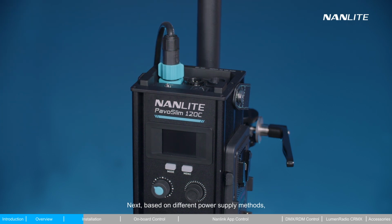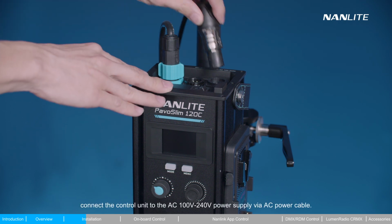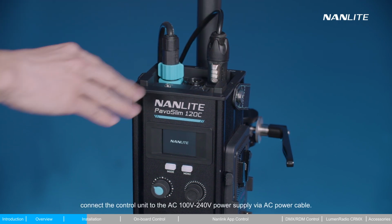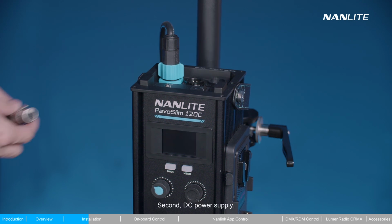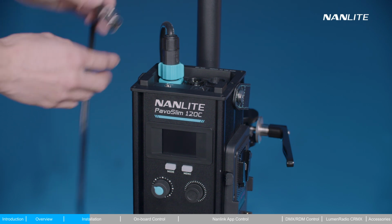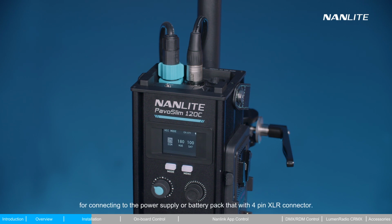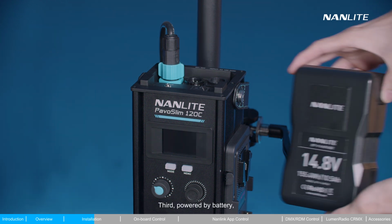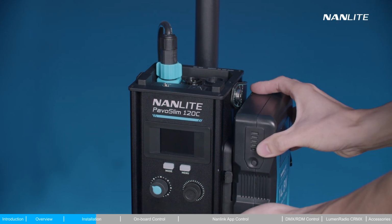Next, based on different power supply methods, there are 3 connection ways. First, AC power supply. Connect the control unit to the AC 100 to 240 volt power supply via AC power cable. Second, DC power supply. The PavoSlim 120C is built with a DC input socket for connecting to the power supply or battery pack with a 4-pin XLR connector. Third, powered by battery. Mount the battery on the battery holder.